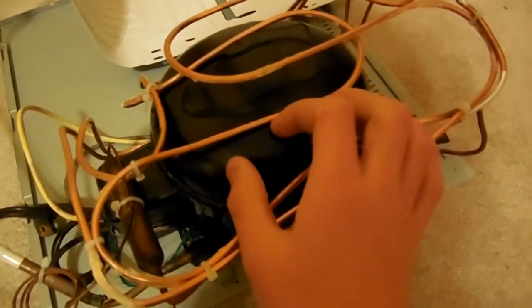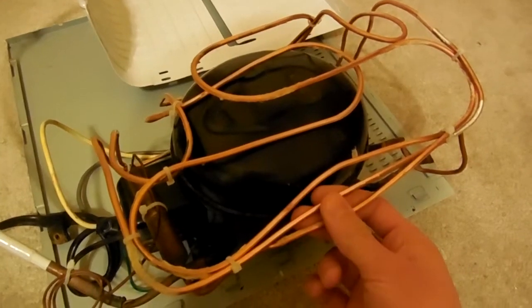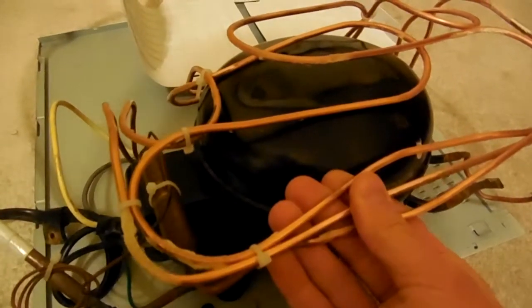And the tiny compressor, it's quite small, but it can do fairly high pressure, and you don't need a bunch of airflow for this thing, or a bunch of pumping capacity, so it works perfectly fine for this application, and that's why they're used. And the loudest sound that's coming from here is the refrigerant flowing through this orifice. And so all of this piping is getting warm. It's lukewarm right now. And then already this is getting nice and cold.